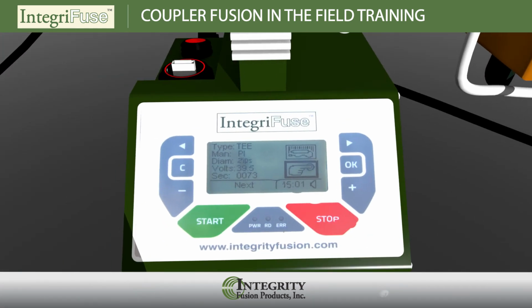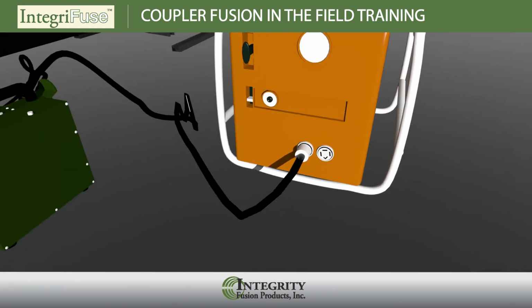Depending on the level of traceability chosen, follow the prompts and answer the questions on the processor screen and press OK to proceed to the next screen. On the final screen, you'll be prompted to choose between beginning the fusion or to abort the process. Press Start to begin fusion.